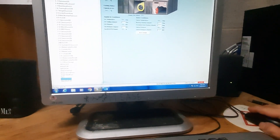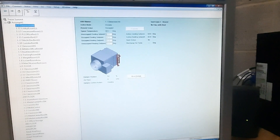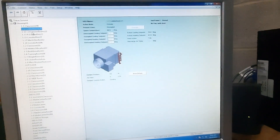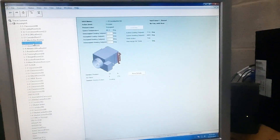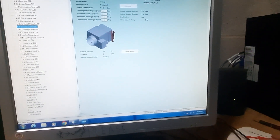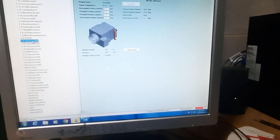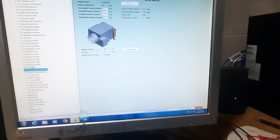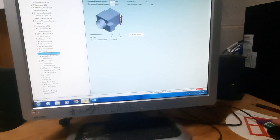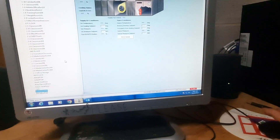I used to like the old Tracer Summit. He disconnected yesterday, so we're at 64 degrees and it's pretty cool everywhere, so this thing ought to come in. As soon as you power it up, it's probably going to go into a morning warm-up. The biggest thing I want to do now is get power to it and make sure our crankcase heater's on for as long as possible. Everybody's going to recommend 24 hours, but it's not going to happen here unless maybe we come back. It's the holiday weekend, so maybe come back tomorrow, but we're going to verify rotation and everything.